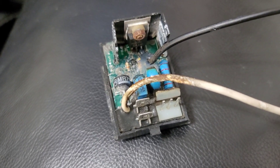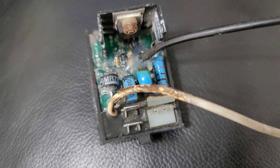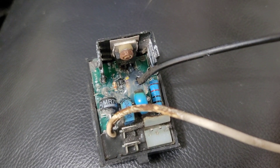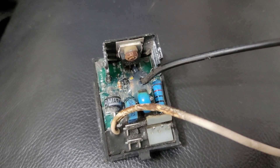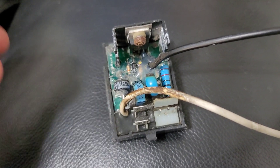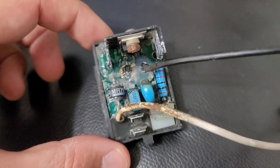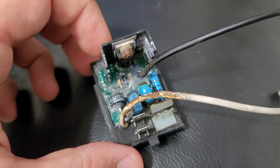You'll find in the description a Mouser.com project cart that has all the necessary parts you need to rebuild one of these boards. There's not really a lot going on with this particular board, and if anything is missing or out of stock let me know and I can try to update it and find equivalents. To service this board you need a hot air rework station to heat up this black epoxy here — anywhere from 400 to 425 degrees — just right below the melting point, but it will make it soft enough to peel away and allow you to work on the board.